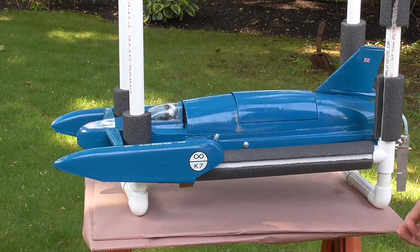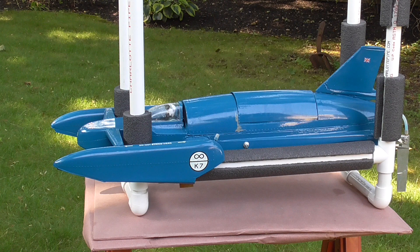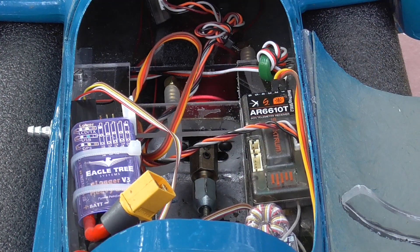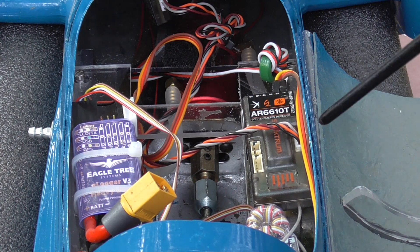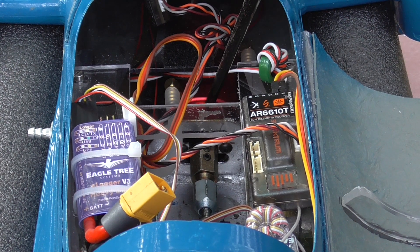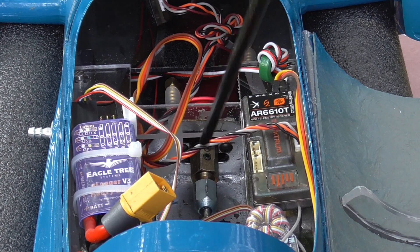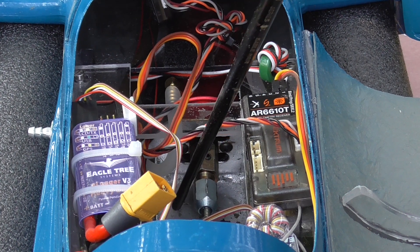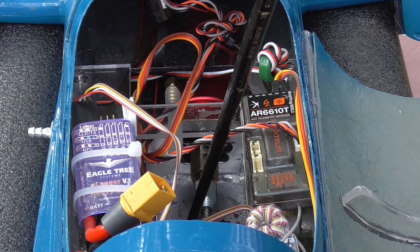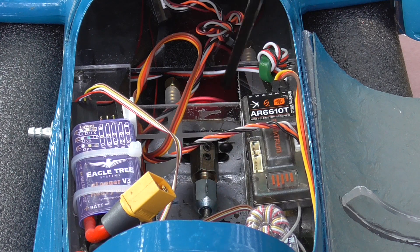It's driven with a flex drive. What we see inside the machinery spaces is, first of all, a motor down there which is a 2750 kV motor, driving a flex drive shaft out to the propeller — very conventional. The motor is mounted on a plate to which the propeller shaft outer tube is brazed, which means I guarantee the alignment of the propeller shaft to the motor shaft.